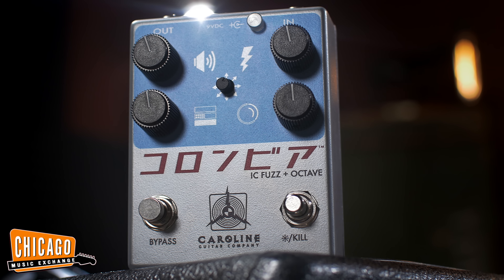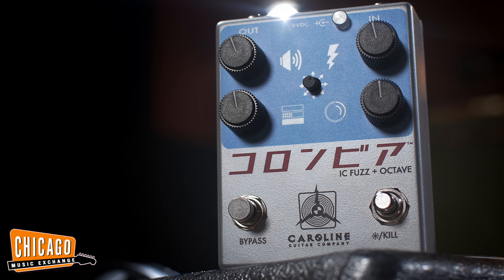The Shikaharu is a multi-stage fuzz based on some of the design elements of 1970s classics like jumbo tone benders and big muffs. But where we made some key differences was in the staging of the gain. The outer two stages are done with op amps for better input impedance, clarity, performance, and responsiveness, while the middle two stages, which provide the clipping, are still done with BC184 transistors.